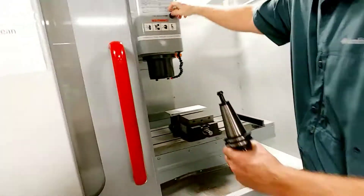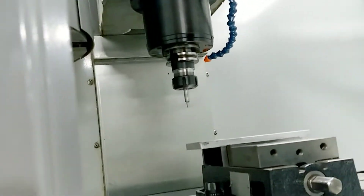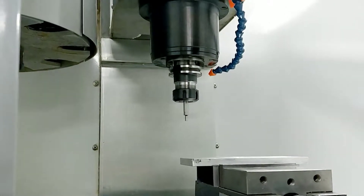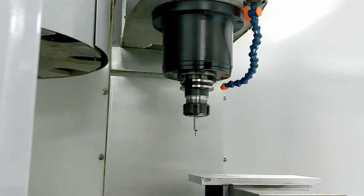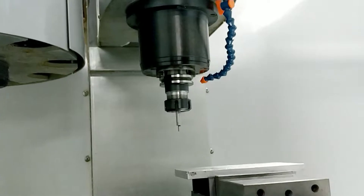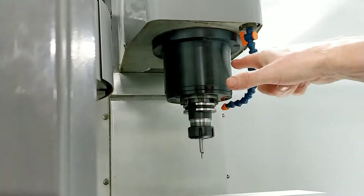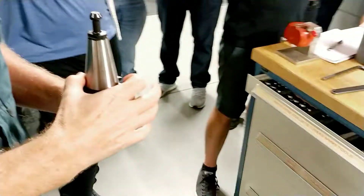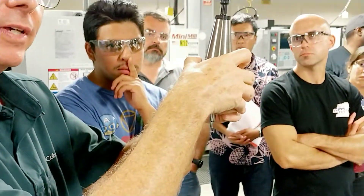The machine will hold the tool even if you don't clock it — but that's bad to do. When the clocking lugs are not lined up, that gap is extra big, and when the tool changer goes to put the tool away it's not lined up and will cause all sorts of problems. Whatever you do, do not put your finger in that gap to check it — many times I've seen students get right at the edge of that corner and it pulls the tool up and squashes the finger.